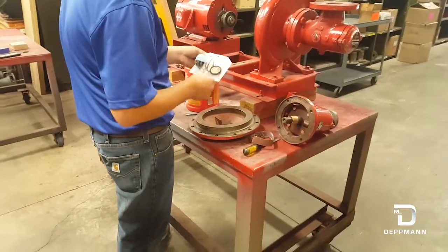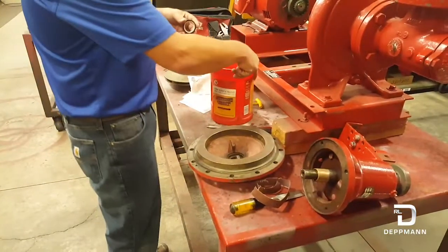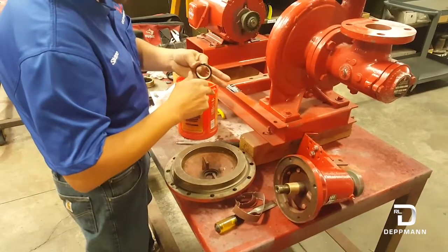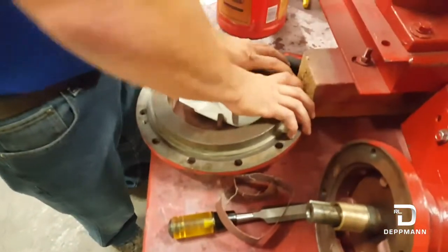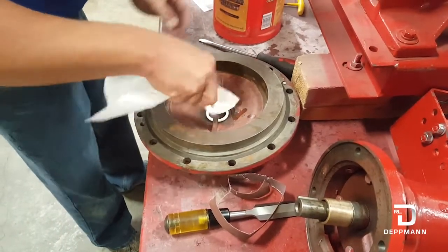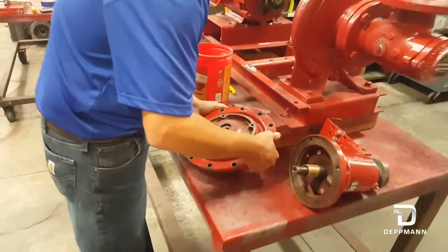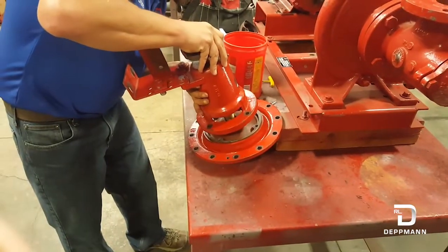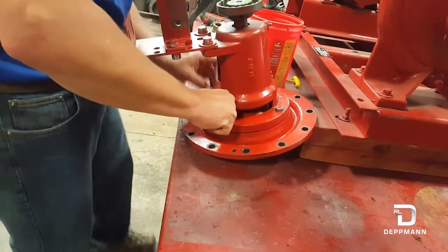So I've got a new seal kit here. It's got our stationary piece, our rotating element, and our spring. I'm going to install this. I've got a container of soapy water here that I'm going to use around this rubber boot so it goes in nice and easy. They do not want you to use any type of grease or oils or anything like that. I'm going to press this in using a piece of paper towel — you want to try to keep your fingers off it if possible. If you do get your fingers on it, you can just wipe it down with a clean rag. You just want to make sure it sits down in there nice and flush all the way around. Now we've got our stationary seal in. We'll flip this over — it makes it a little easier to take this bearing assembly and guide it in. You want to be careful not to knock that ceramic out when you're installing this. Put these bolts back in and tighten them down.